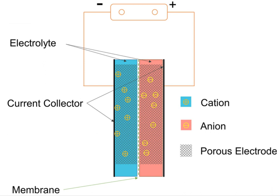Topic: Conductive polymers. Another approach uses electron-conducting polymers as pseudocapacitive material. Although mechanically weak, conductive polymers have high conductivity, resulting in a low ESR and a relatively high capacitance. Such conducting polymers include polyaniline, polythiophene, polypyrrole and polyacetylene.